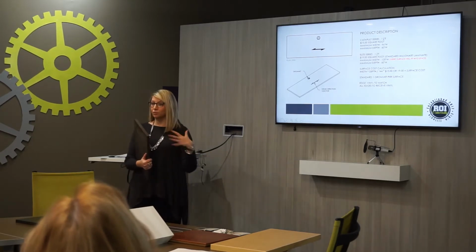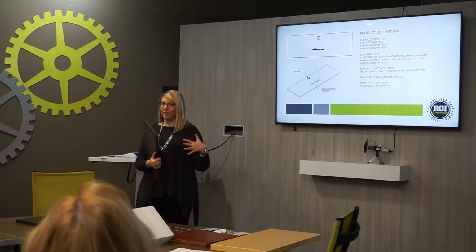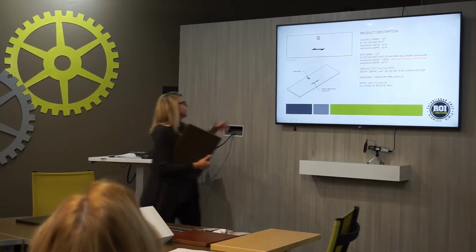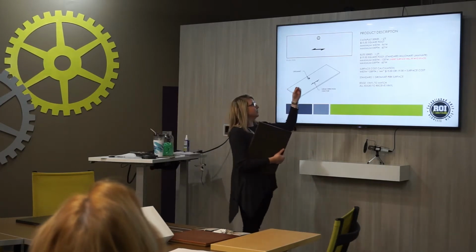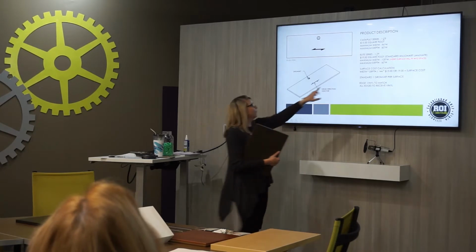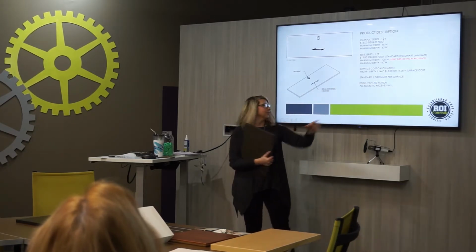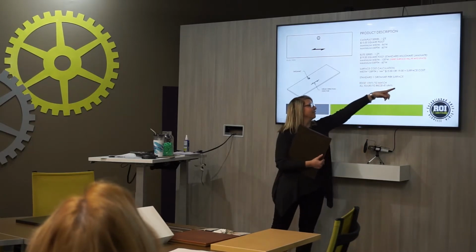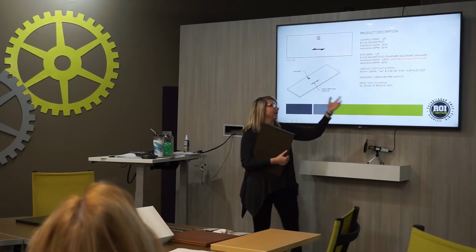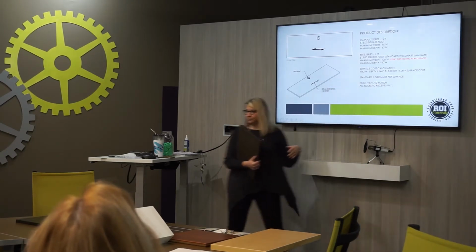There are restrictions with board sizes and stuff, but the designer typically notes that on the drawing, that there could be something funky going on with your grains. When we're pricing out Catapult series, it's always $15 a square foot. If you ever want to give a client that price, you can always do this little formula that we have here. It's the width times the depth divided by 144 times 15, or times 19, because 19 is the Elite series.